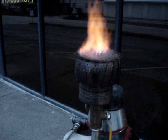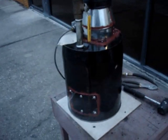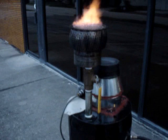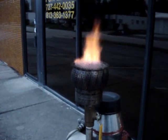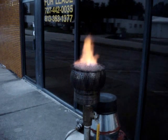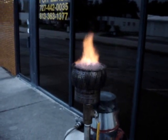This last modification has really cut down on the amount of tar. And this gasifier is burning hotter than ever too. The body of it is just amazingly hot — I don't think I've ever seen it get this hot before. I think that constriction is allowing the temperature inside to rise much higher than before; it's cracking the tars, and I'm getting much cleaner gas out of it. With a filter unit or a decent cyclone, I think I'd have engine-ready gas right now.